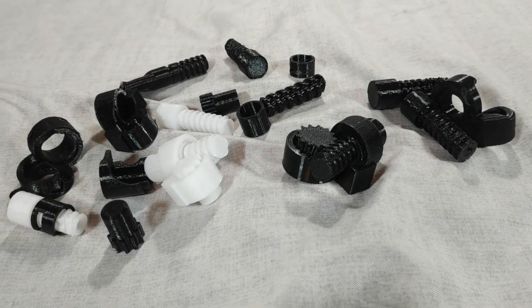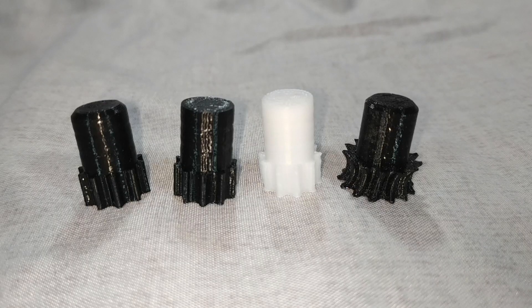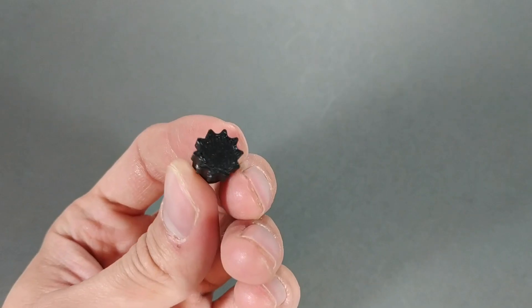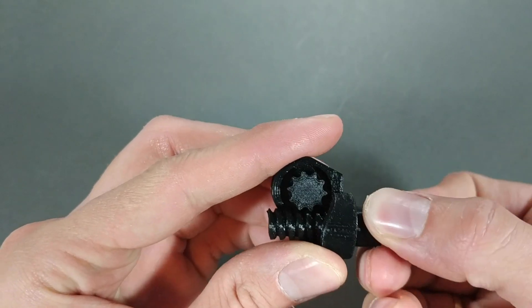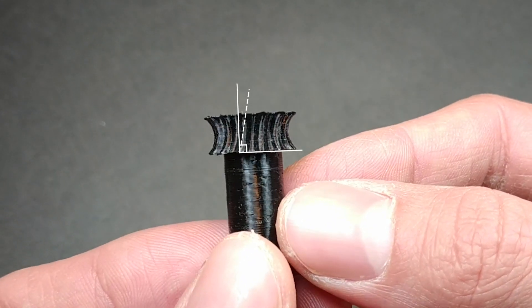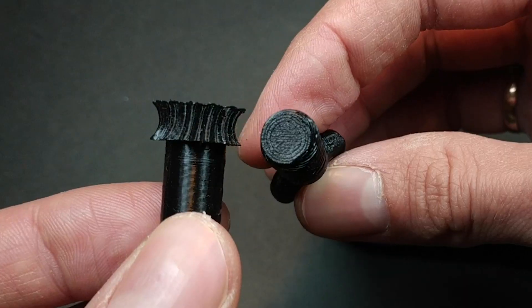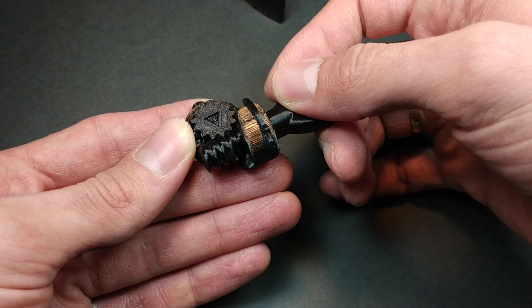I came up with this design through a lot of trial and error — I had to try again and again until I got it right. I started out with this gear over here but I couldn't understand why the worm wouldn't turn it. Then I tried to make this gear's teeth a little bit on an angle and have the whole thing wrap around the worm so it'll have maximum contact. Now it works great — look at how smoothly it turns.